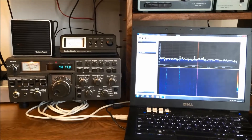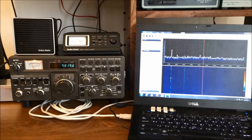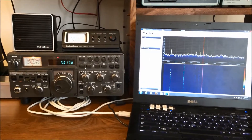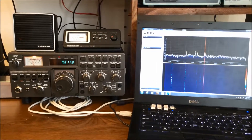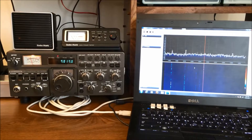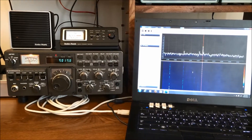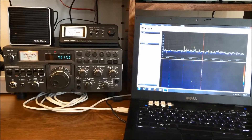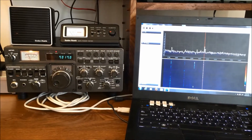This is a video showing my old Kenwood TS-180S being connected to a PC that's acting as a pan adapter. I've got the Kenwood TS-180S IF jack number one, which is a broadband signal — a low-level signal that's buffered.